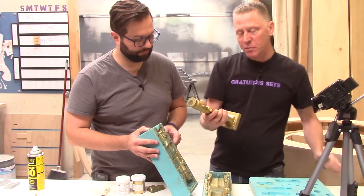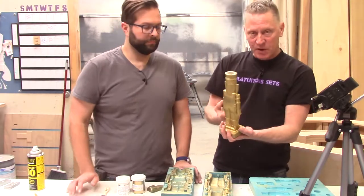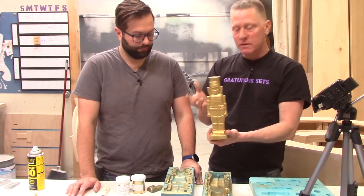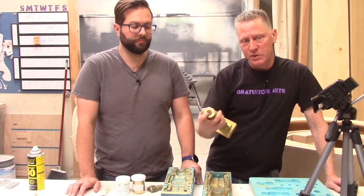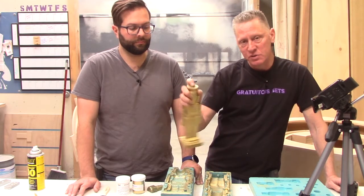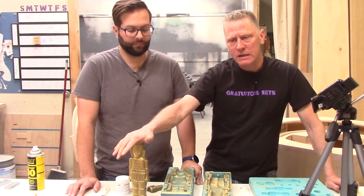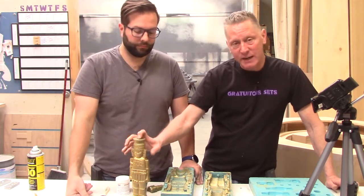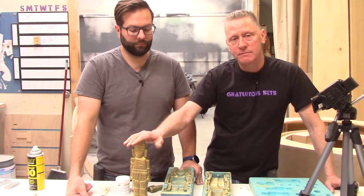So we're going to pour this a bit slowly now that we've got Kevin and I both working together. We'll rotate this and try and purge all of the bubbles up through the center as we go. So that's going to be something we have to tend in our pour, and hopefully we can eliminate all or most of that. We're pouring through a spout that we made in the top of the piece. We will grind that smooth, sand it off, and then just use some Rub 'n Buff or something else on top of it. Rub 'n Buff is a buffable metallic wax. I can pick some up at the art supply store, and we'll get it in brass so that it matches the rest of the piece, and buff that guy out and hide our crimes.